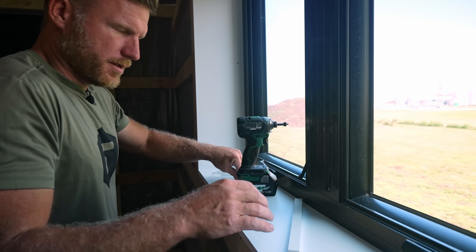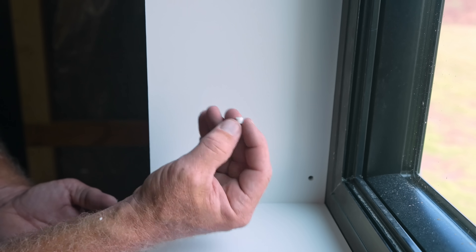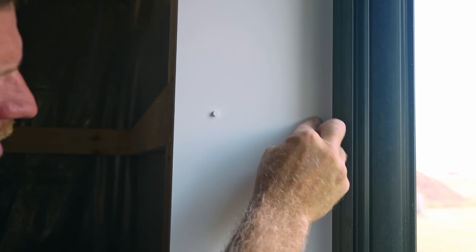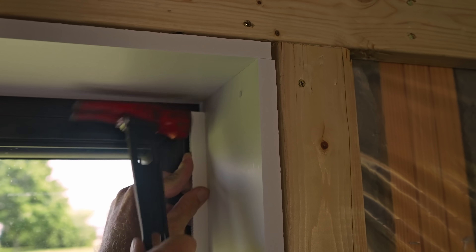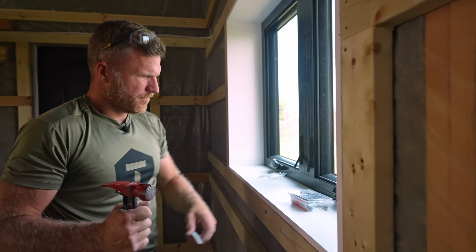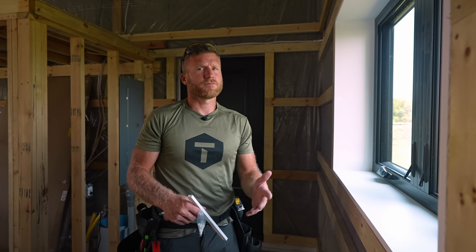This is not a house, this is a garage, so it's okay. The plugs have a little bit of a taper — you get your finished side and it's tapered just to get it started so it wedges tight in there. Now we've got our jamb extensions on, the window's sealed, and now we're ready for our metal J-channels — which, once again, this is a garage, not a house.